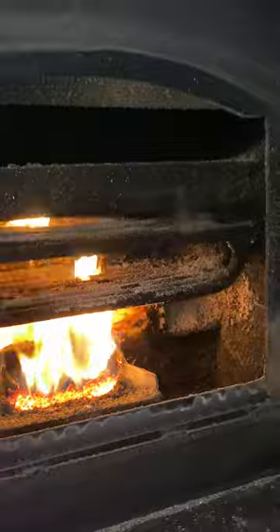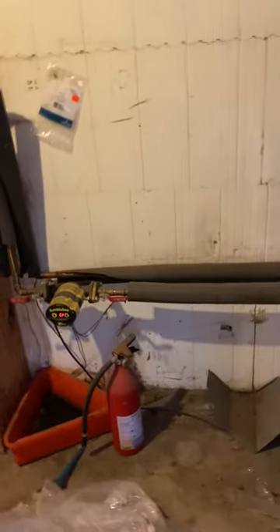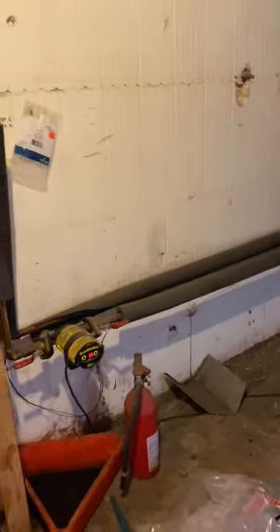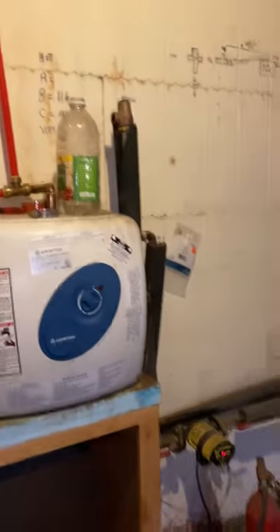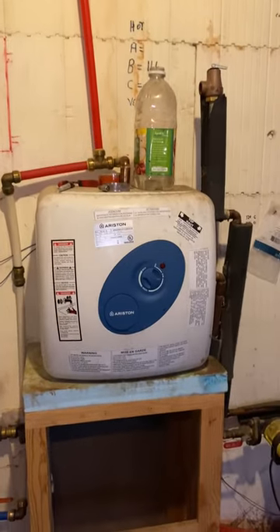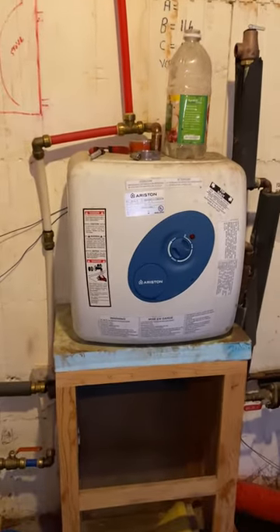Let me show you the finger loops in here first. The water goes through those loops right there. I still get the use of my pellet stove plus I'm heating my hydronic floor. It comes across here, and there's my continuously flowing pump. Then I have this eight or six gallon deactivated electric water heater for a mix tank.